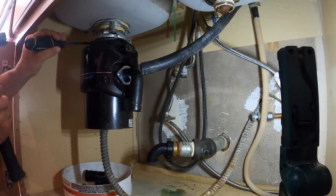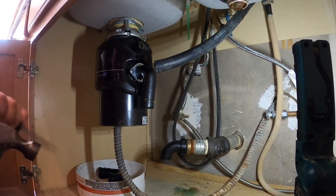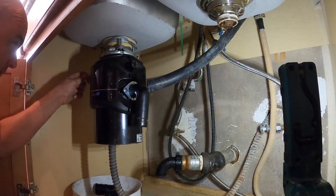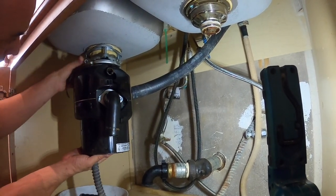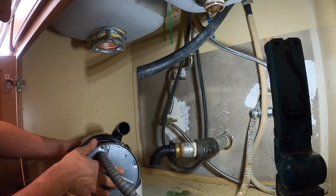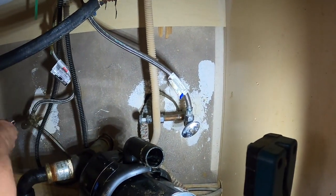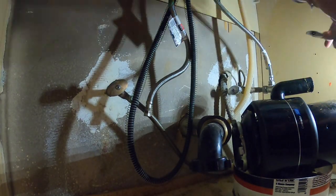Now I'm removing the garbage disposal and that's locked in real tight as well. I'm just starting to hit it a little bit with a hammer and a screwdriver, and then I've got my garbage disposal wrench or key and we'll loosen that thing up and remove it. I'm not worried about the electrical component — of course I don't have the switch on for the garbage disposal. I'm going to leave that attached for now and disconnect the flex connectors for the water supply on the hot and cold side.